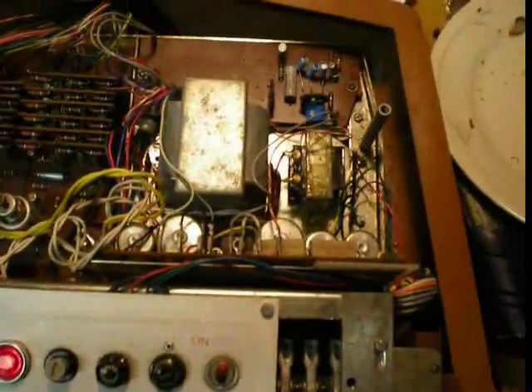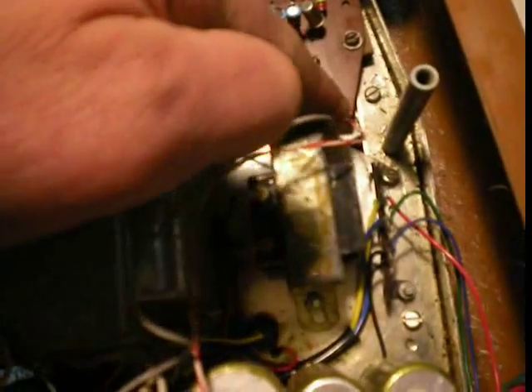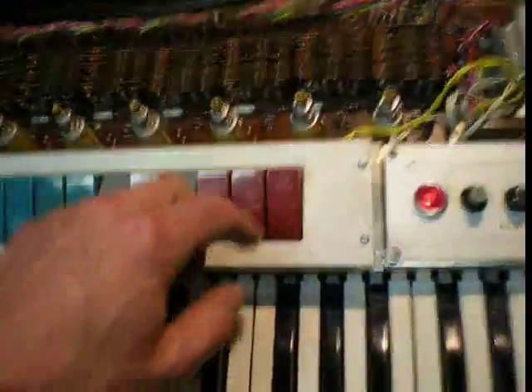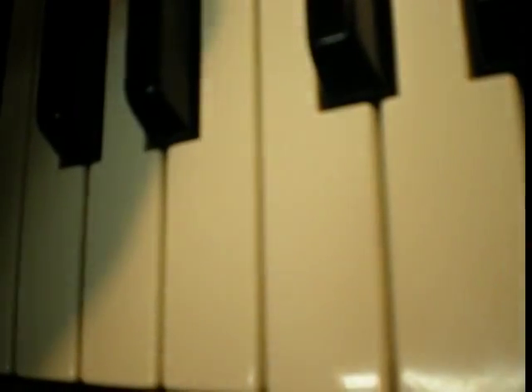Captain's Blog, Star Master. I've been working on this for almost a week. I added a little variable resistor right there — you pull the 220-ohm resistor that sets across right there and add a 470-ohm that you can vary. That's going full. It worked a second ago.